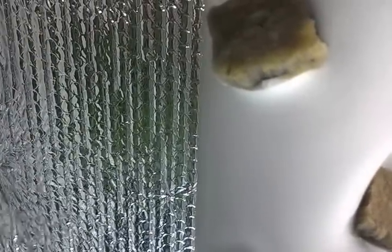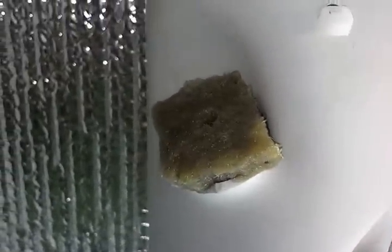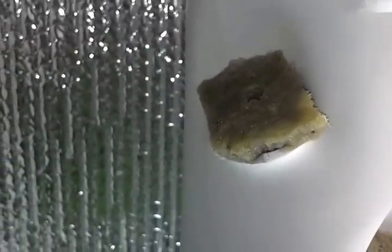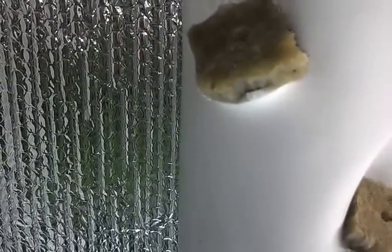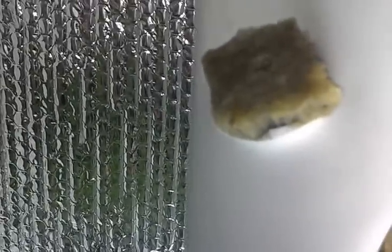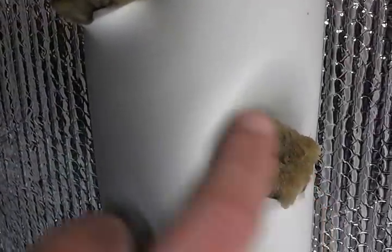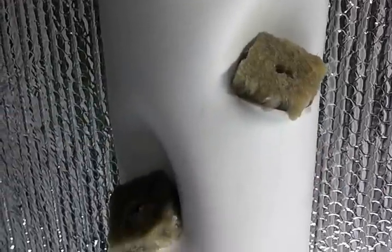then the jig would, by way of implementing a heat gun into it, blow hot air on there until the PVC is soggy. Then a form comes by, the blade slides out of the way, the form slides into place, pokes the hole in there, and then cool air is blown on it to cool it down. After that one's done, the jig would rotate the pipe so far, so you could do one over here, rotate the pipe and slide it, and just do that over and over.